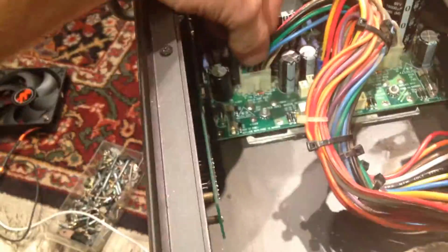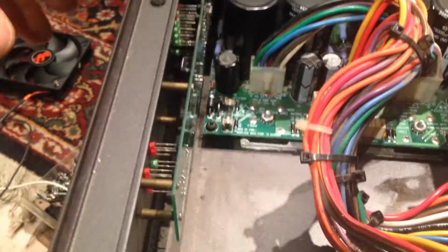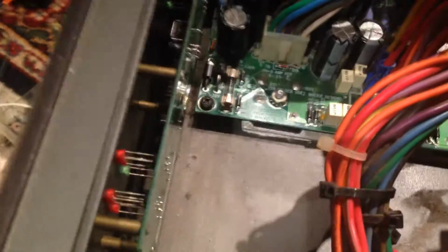it, and it's good. A couple of the wires into these connectors here were actually loose. You know how it has the little wings that come out that holds it in its socket? So I replaced those. I actually have some of those and soldered them in. And a couple of the fuse holders were loose, so I tightened those back up and cleaned them. Checked the diodes.